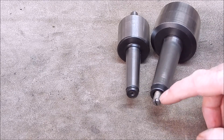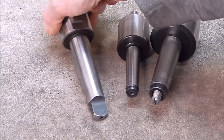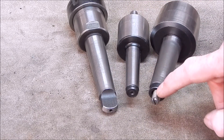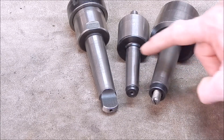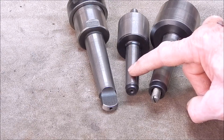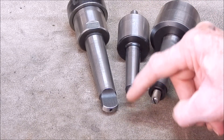The easy setup is to just drill it, tap it, and put a little stud bolt in there. This particular live center came already drilled and tapped so you can screw in a tang, and you can get tangs which are a proper regular tang like that with a thread on them and they just screw on. But you don't have to have a tang that shape — it can be round — it just has to be something that sticks out. We're going to drill this, which I don't expect to be hard. Definitely with a cobalt drill you'll be able to drill it. If it's too hard to tap, we'll just machine up a bit of rod or a stud, lock-tight that in there, and that'll do the job.